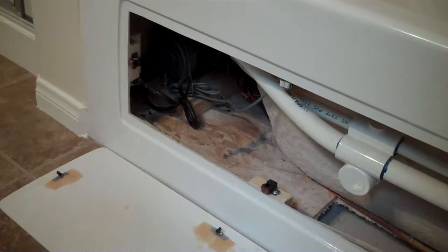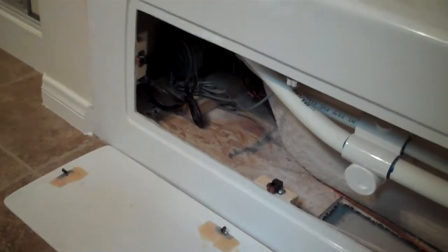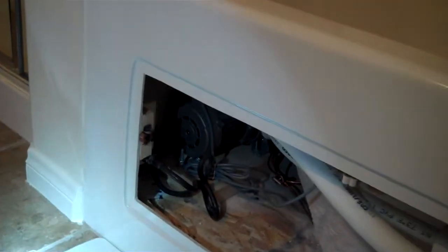For the tip of the day, one of the newer requirements as of 2011 is that our whirlpools, tubs, and bathrooms have to have access — large accesses — so you can actually get to the motor. And for home inspection, it's great because we can also check for leaks.